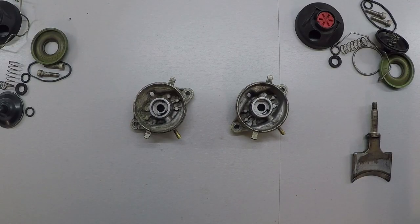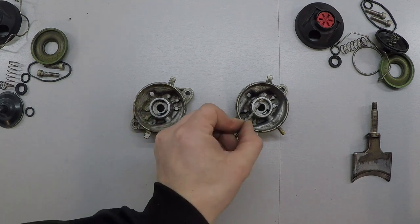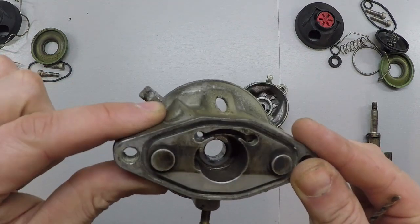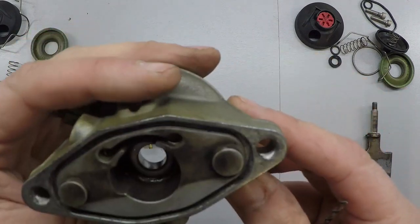This next thing we're going to do is more for a performance boat — you don't really need to do this if your boat's stock. The way these valves are controlled is electronically, but we're going to actually go and control them now by exhaust pressure. You can see on this one I've got a hole drilled in it, whereas this one does not — so this is the stock one and this is the one I've already modified. Some of the older C2s would come stock like this but the 951 ones didn't, so we're going to drill this out and I'll show you how to do that.